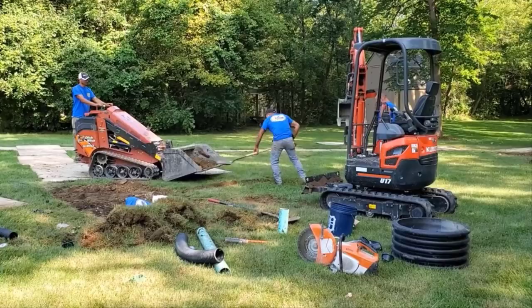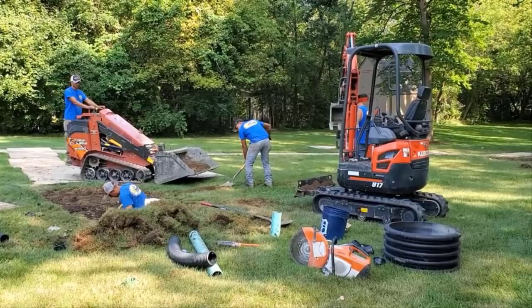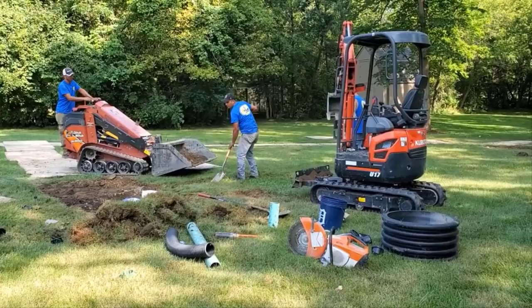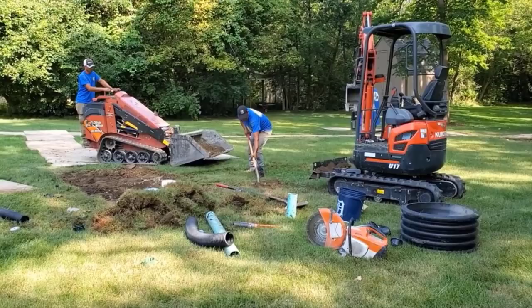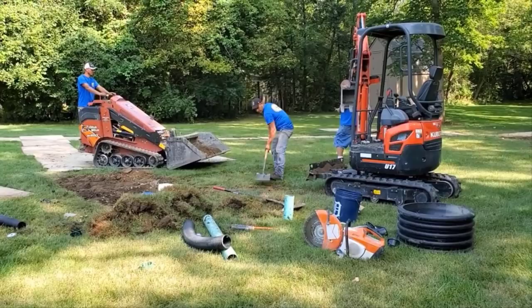Do you know where the overflow on your sump line goes? Because it's buried. There's an overflow on the sump. I've got a little extra pipe going over here. It comes right off your sump line off the house there. If this ever froze up, I'm going to cover it with straw to insulate it. That's called freeze protection, so that if it froze up, it would dump just on the outside of the house, and if the ground's frozen solid, it'll just run away. But it's buried underground. Somebody connected a pipe to it, so I'm concerned that it could freeze up and you lost your freeze protection.